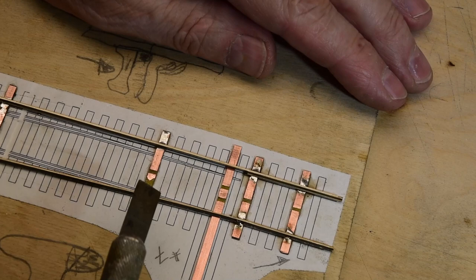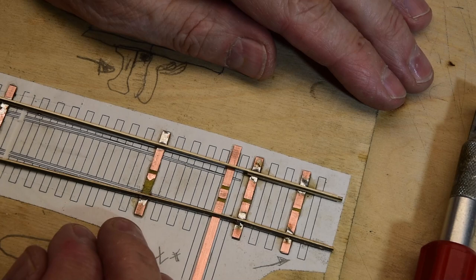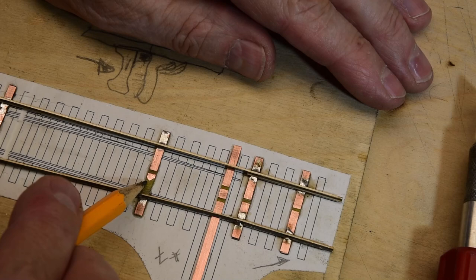When I was talking about this particular tie here, any tie that gets a little bit of buildup that you want to clean up, you can try filing it. And there are different ways you can use a rotary tool. I don't like to use a rotary tool because you can slip with them and they cause damage. And with the file, you can overfile too, and also file into this fiberglass PC board. That's where all the strength is. It's not in the copper, it's in the fiberglass.